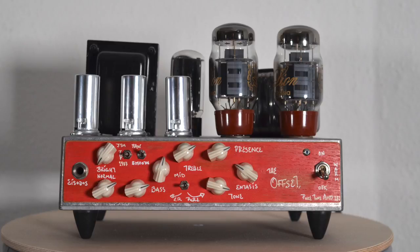The EQ, as with most tube amps, is of course passive. That means it doesn't act like the EQs you know from your other bass amps or your active bass EQ. The controls for bass, mids, and treble aren't working individually but influence each other. For a passive EQ, I have to say it's very easy to use. With some other amps you can spend a lot of time finding the right setting — here it's super easy and intuitive.